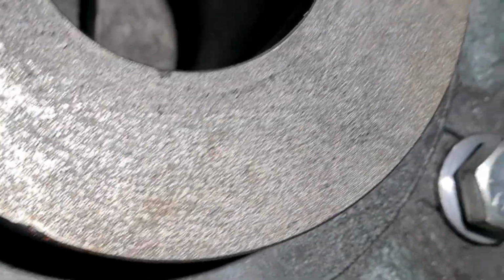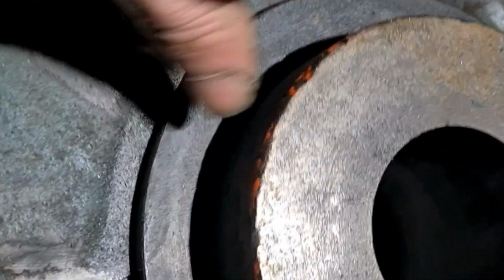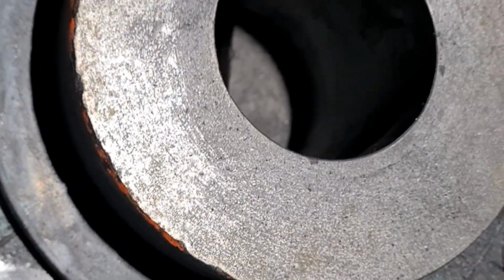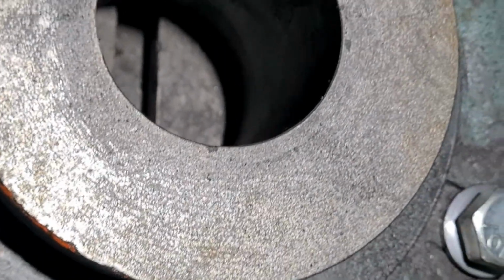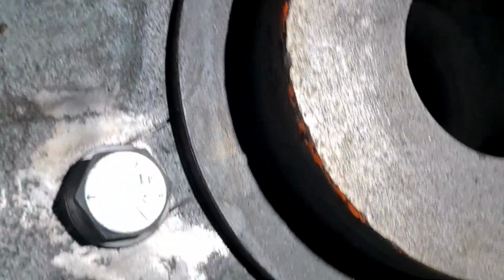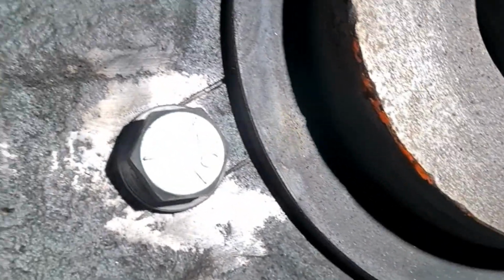All of those got a washer in them, as you can see, look. So that was my thought on that. I thought that was the best way around it. And he wanted a washer on there anyway, because it's only like a tin backing plate of the drum. So he needed a little bit more support than just the bolt head. So I think that was a fair and a good job all round.